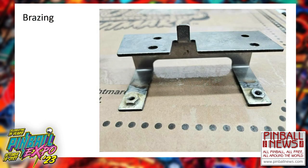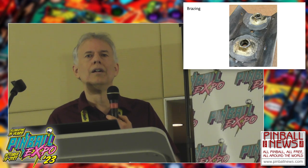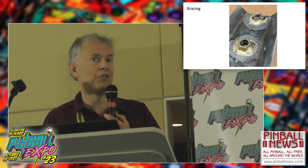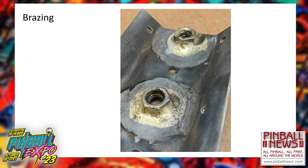Some more examples here — this had some stripped threads in the frame and some new nuts got brazed on. This is inside the nuts that hold on some pinball legs. Brazing may not look as strong as welding, but it's extremely strong — you could hardly knock these off with a hammer and chisel; you'd kind of have to grind them off. An audience member asks about brazing stainless steel. The answer: best to start with plain steel nuts, as heating zinc-plated ones burns off the zinc and you're left with steel anyway.